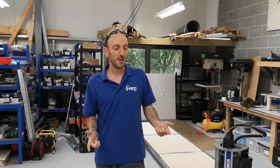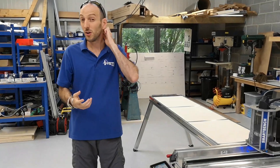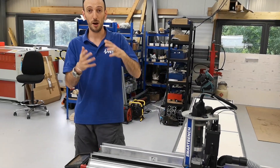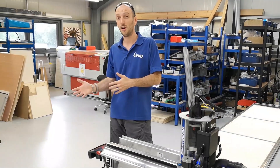What that means is that we are vastly more efficient in the structure which makes up the CNC machine, and that means we can break the beam down, break the bench down, and then we get our portability — and that really is the crux. Traditionally a large part of what you pay for in CNC machines is rigidity, and that's why all the traditional large format CNC machines are large, heavy, and live in factories. It's this new take on the mechanics — putting rigidity where it's needed, with the router spindle rigid relative to the top surface of the material — that means we can create a portable large format CNC machine that is an order of magnitude cheaper than the traditional way.